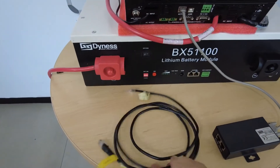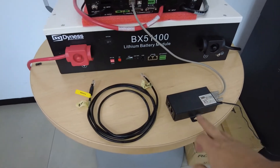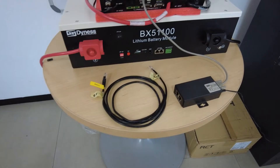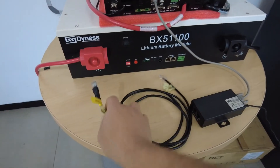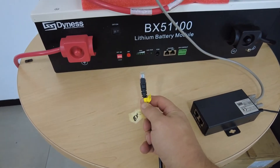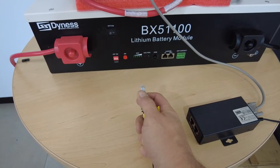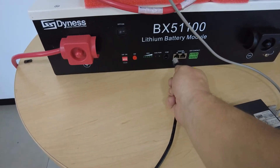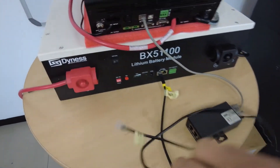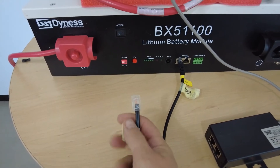The cable leading to the battery needs to be modified. The cable that came with the BMS box has incorrect pin outs, so you need to change that. I prefer to keep the cable on the battery end as a normal networking cable, so you can use any general network cable with the standard networking color code. This connects to the battery input, and the other end goes to the BMS box where you'll need to change the pin outs by changing the plug.